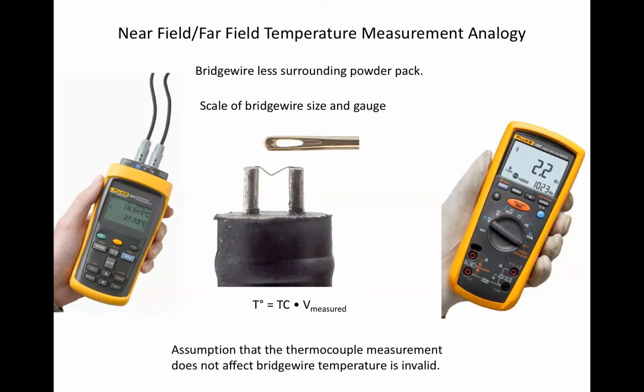All we need is the measured thermocouple potential for the DC and RF cases. The thermocouple corresponds to the antenna, the voltmeter corresponds to the spectrum analyzer or EMI receiver, temperature corresponds to field intensity. In either case, we need neither once we have specified the correct transducer. The only real figure of merit is the induced potential at the transducer output. And that is it. That's my simple analogy for when the results of a measurement depend on how you instrument the measurement.